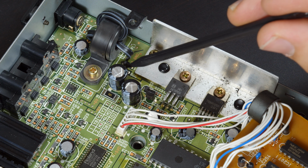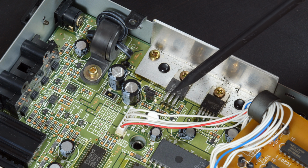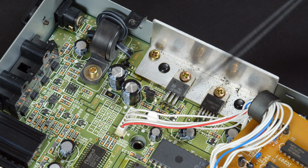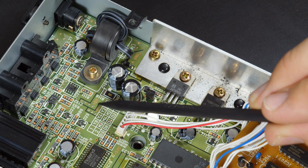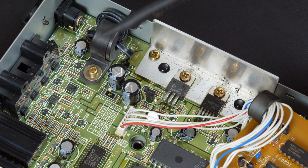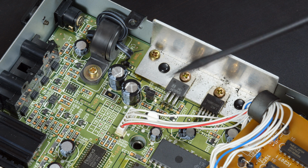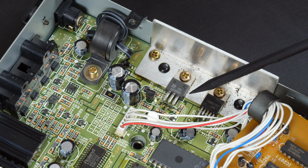Inside, it looks like this thing uses DC. We have a 7806 here and a 7805 there, and we see plus 6 and 5 volts on the circuit board, but there are also -6 and -5 volts marked on the PCB, which is strange because I don't see a 7906 or 7905, but apparently it needs it and it's generating it somewhere amongst all these chips. So I couldn't power this directly by replacing the power supply with something DC.